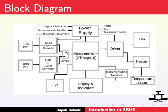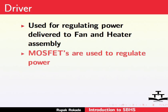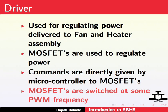Next comes the driver block. This is a device which varies the amount of power delivered to the fan and heater. MOSFETs are used for the same. They are operated as per the commands given by the microcontroller. These MOSFETs are actually switched at some PWM frequency.